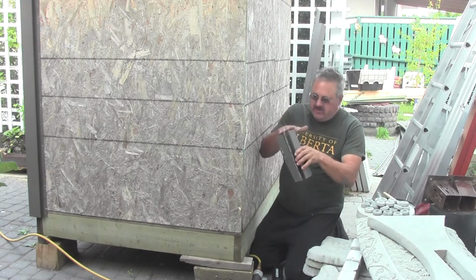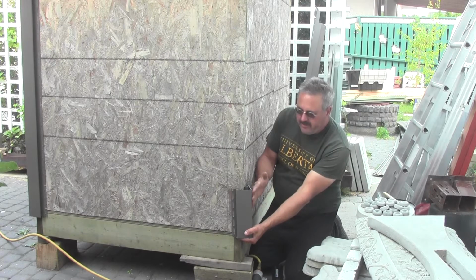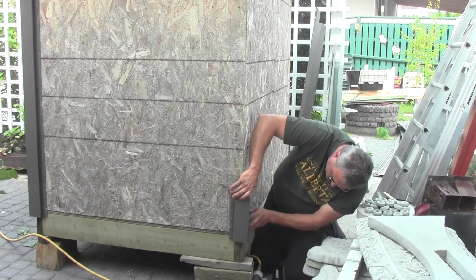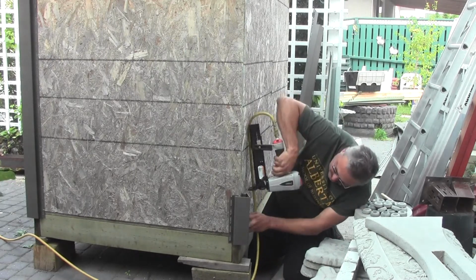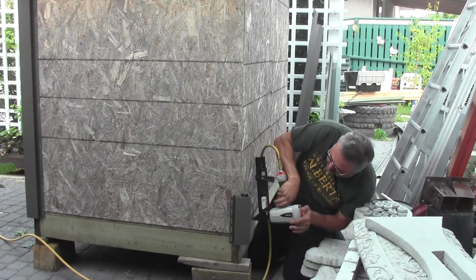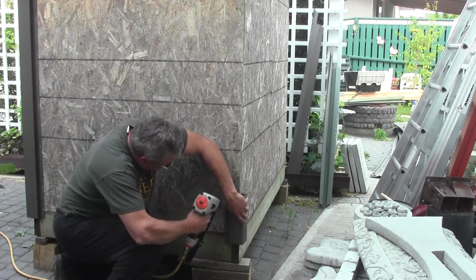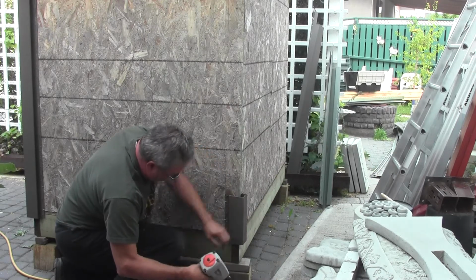That's really easy. You just take a short piece of corner, and you put it on the bottom, and then you overlap the top piece. That'll actually save you the cost of one length of corner. So we're just going to take this and put it on our bottom mark. Now, make sure you overhang this a bit so that the other side, line it up with your marks, there we go, that's all there is to that.